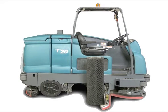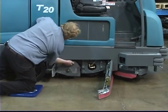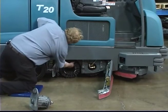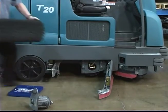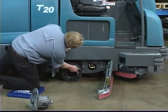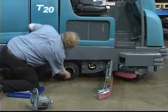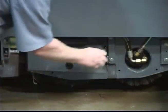The amount and type of soilage play an important role in determining the type of brushes to use on your machine. For best results, use the correct brush type for your cleaning application. For maximum brush life and best performance, rotate the brushes front to rear after every 50 hours of operation. The brushes require replacing if the remaining brush bristles measure 15 millimeters or one half inch in length. Always replace the brushes in sets to prevent one scrub brush from scrubbing more aggressively than the other.